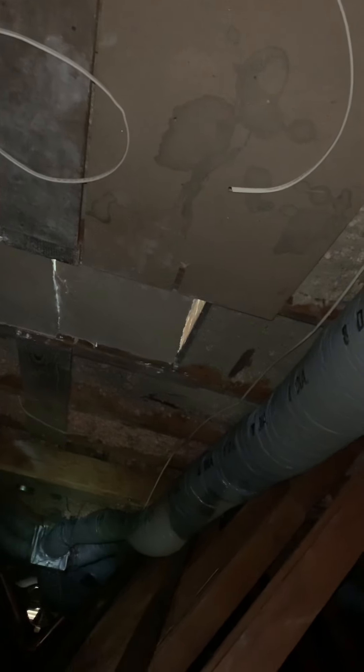There's never going to be good airflow — it's just too far away from the system. You'd have to run a hard pipe trunk line all the way back here, and then you could get into some flex. You could probably run something right across here, maybe a 10-inch run all insulated coming into that duct back there for the addition, but it's still not going to be great.